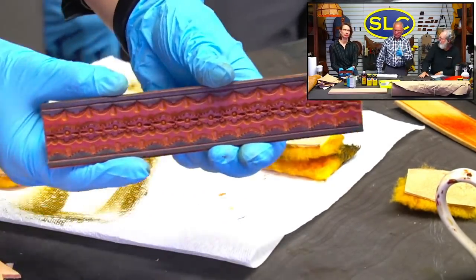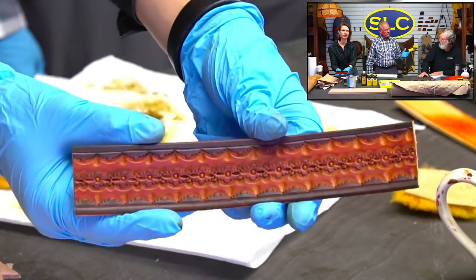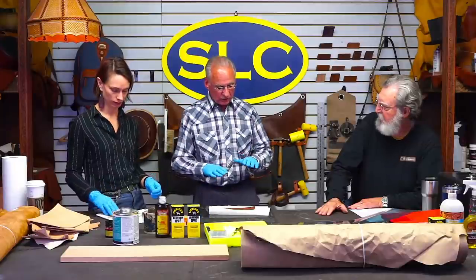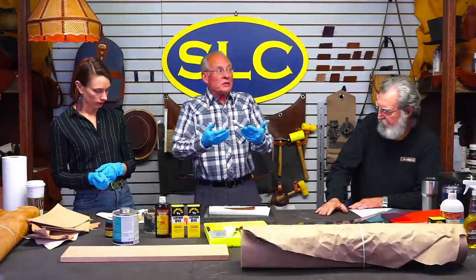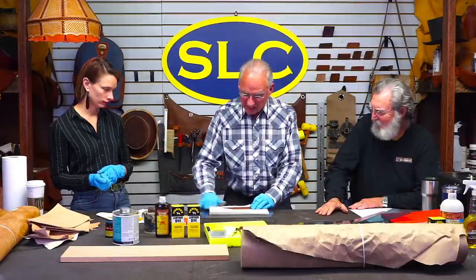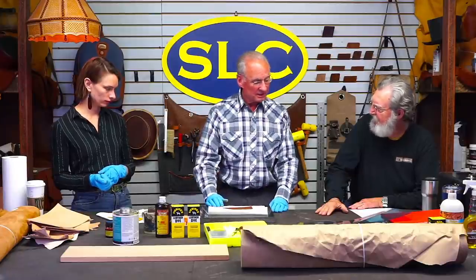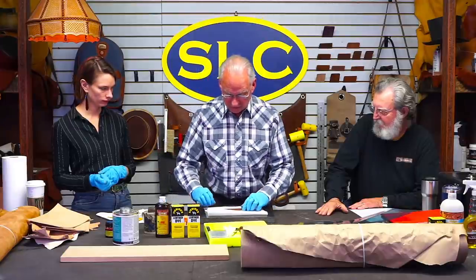Another aspect of this procedure is you can use whatever finish you want. On ordinary antique, you have to be careful that you don't use a finish that lifts the antique out. Well, on this one, you want it to lift the antique out. So whatever finish you put on there, if it makes your applicator tan, that's a good thing. So that's our reverse antique.